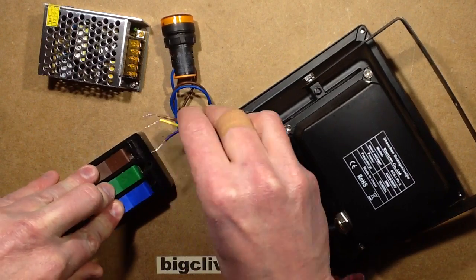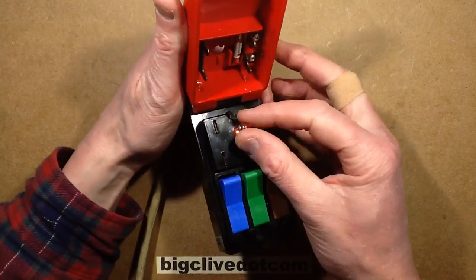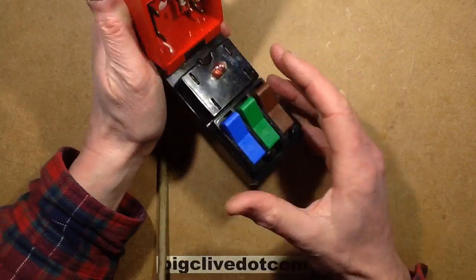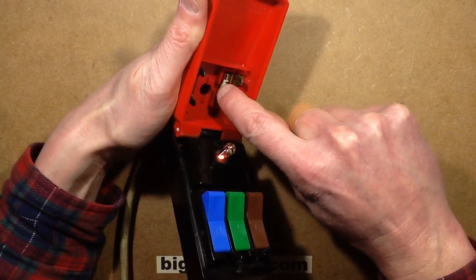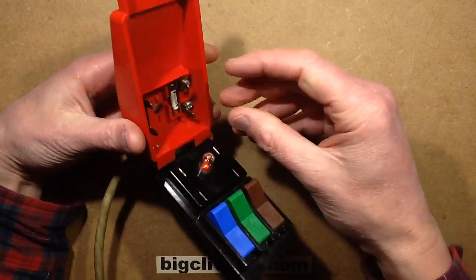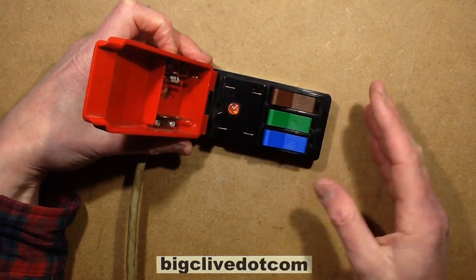It's also very easy to connect to and disconnect from, so let's take a closer look at the unit. It's got an indicator that stays on all the time as long as it's powered, just to show it's active. And it's got knife blades - knife switches - in the top, in the lid, with a fuse on the live one, so that when you actually open the lid up, it completely isolates power going out to these terminals.